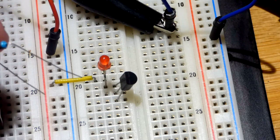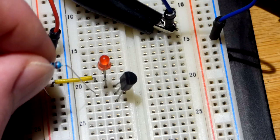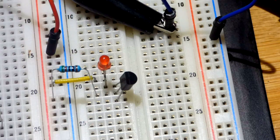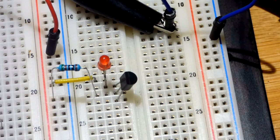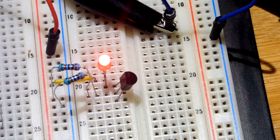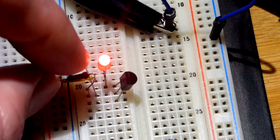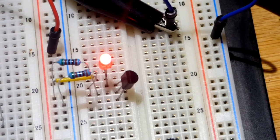We have 10 volts at the rail. You should build circuits with the power off, but this one will be more interesting with the power on. We're going to take that 10 volts and set 5 volts at the source, so we'll be able to get 3 volts or more negative than the source. There's a 510 ohm resistor to the positive rail because we're dealing with 10 volts, to make sure current never gets too high.